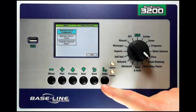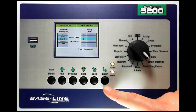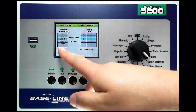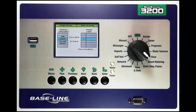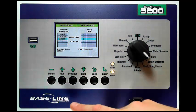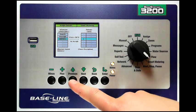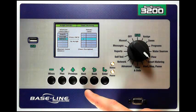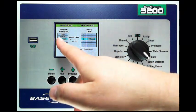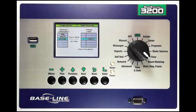To do this, I'm going to go into the first box, Moisture Sensor Assignments, and press Enter to go into the screen. On the left-hand column, I have a list of any of the moisture sensors that are available and have not yet been assigned. On the right-hand side, I have a list of primary zones. I'm going to use my plus key to move up or down on the left-hand side to highlight the sensor I want to assign, and then use my next or previous key to move up and down on the right-hand side. It says press Enter to assign, and I press Enter, and you can see that it moves the moisture sensor from the unassigned to the primary zone assignment on the right-hand side of the screen.